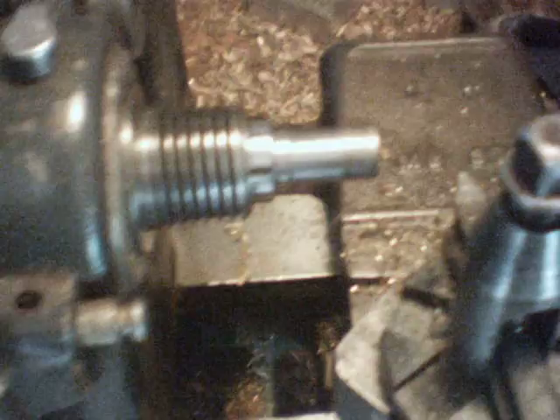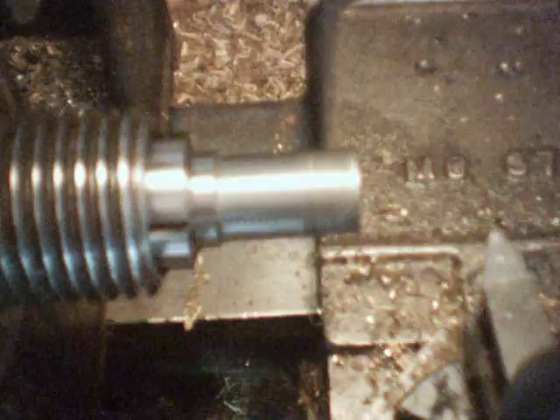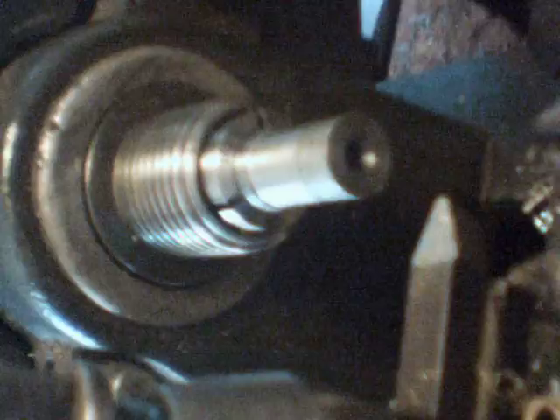So I built this jig. I used a piece of half-inch drill rod held in a collet, turned down to 450, so it should fit the interior diameter of the case. I have a round nose tool on. I center drilled the drill rod. So you can take a cut-down 455 Webley case and slip it onto the little holder.